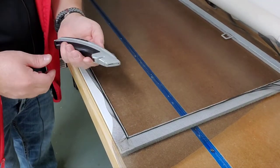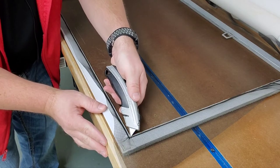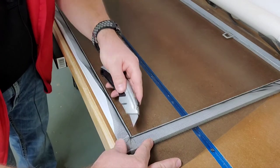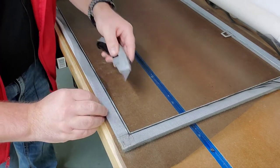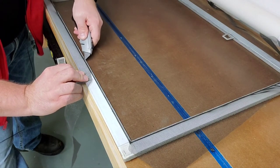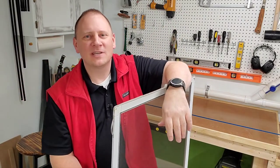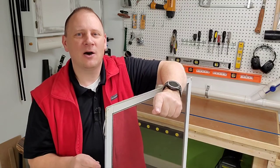The last step is to trim your screen material. Make sure your utility knife is very sharp, and be very careful not to put your hand in the way when holding the frame down while cutting. Make sure your hand is out of the way and go very slowly and carefully, trimming your material as close to the spline material as you can. That looks great and that wraps it up for today. I hope this content was useful. Down below in the description box you'll find a list of the tools and supplies I used for this project. I hope it helps you out and I'll see you next time.